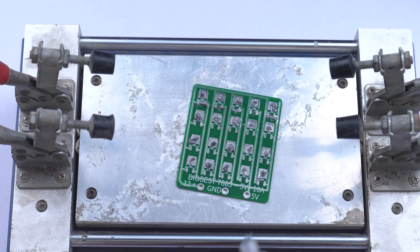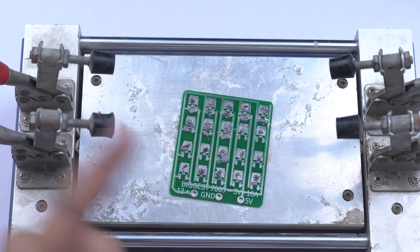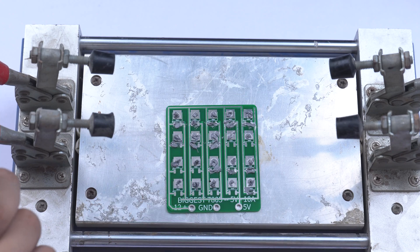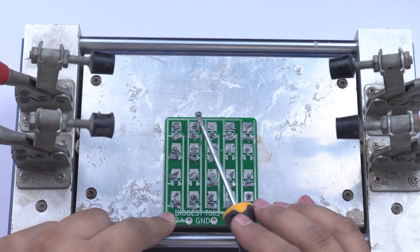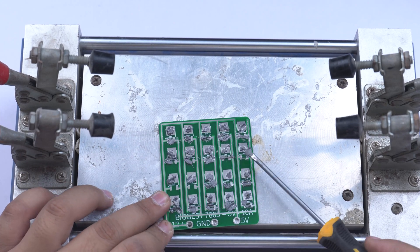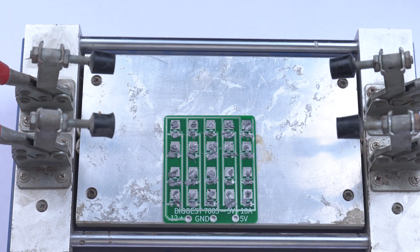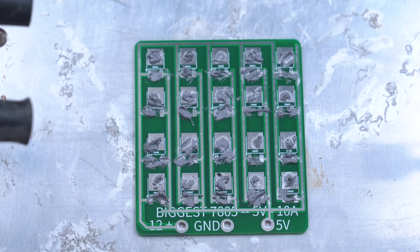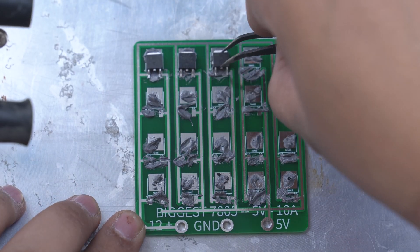I am using a touch-panel heating plate machine, which can reach up to 300 degrees. The PCB and all its components are placed on it, and the solder paste — applied in liquid form — will reflow to solder all components simultaneously.